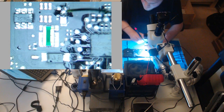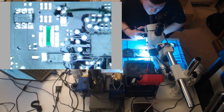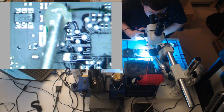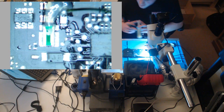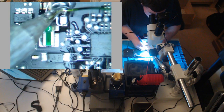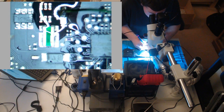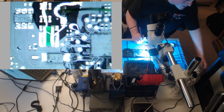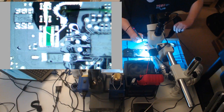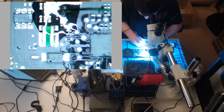as much as I hate to say it, when you have a dead short on PP bus G3 hot, sometimes it could be the CPU. The way the FETs are, they sometimes can take a liquid hit, and better hope it's not the CPU. If I feel this heatsink getting hot when I inject voltage, rest in peace. But I'm hoping it's not that.